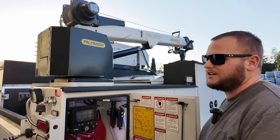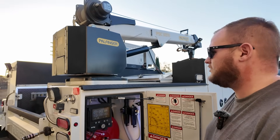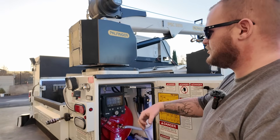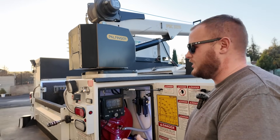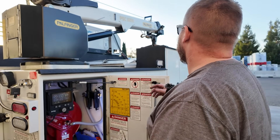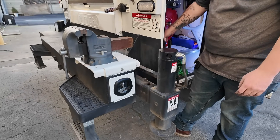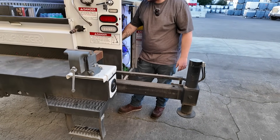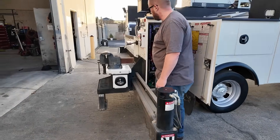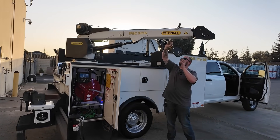This is the hub for the crane. It's actually one of their baby cranes — doesn't do much, but I'm not doing engines out there. I'm picking up radiators, pumps, air compressors, fuel pumps. It's especially useful for lift gates when a cable snaps — I'll use that to pick up the end, fold it back, bring it to the yard and change it. Realistically about 1,400 pounds capacity. It goes 15 feet out!